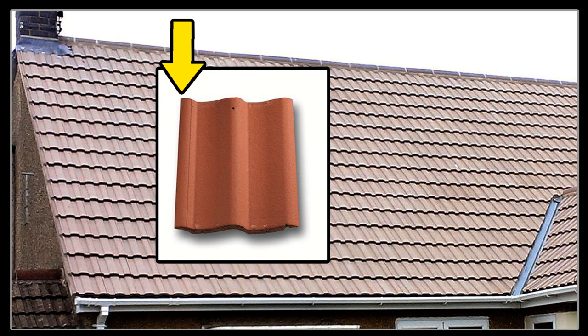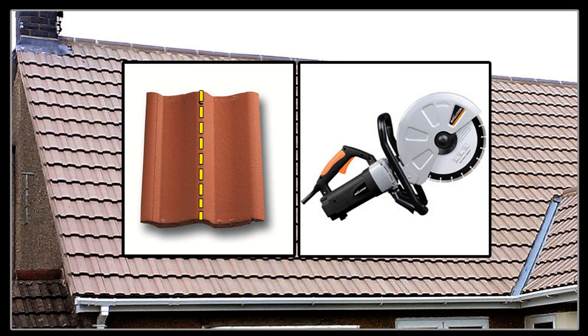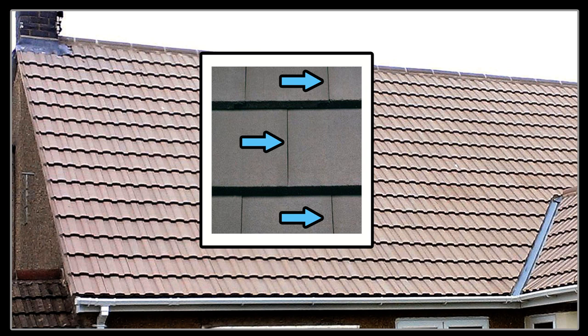Sometimes a cut may be required to achieve this — cut it on the highest part of the tile. If you're using a flat profiled interlocking tile, always try to stagger every course so that the vertical joints do not sit directly above each other. That brings another project to an end — I hope this video has helped in some way, and thanks for watching.